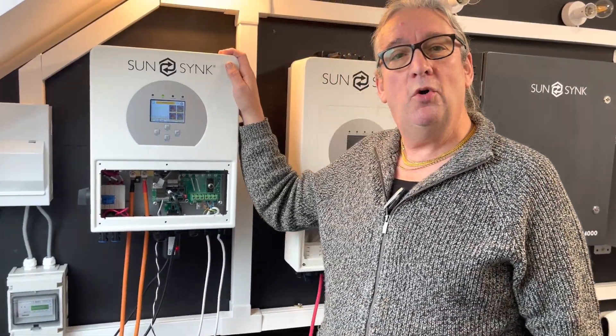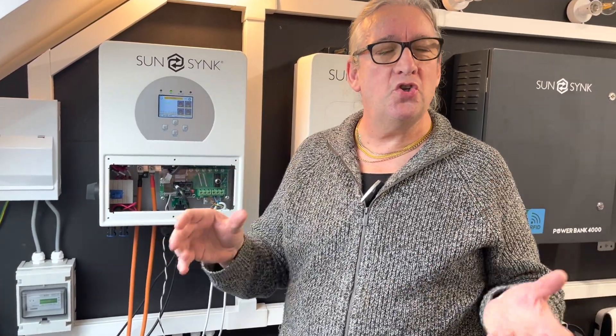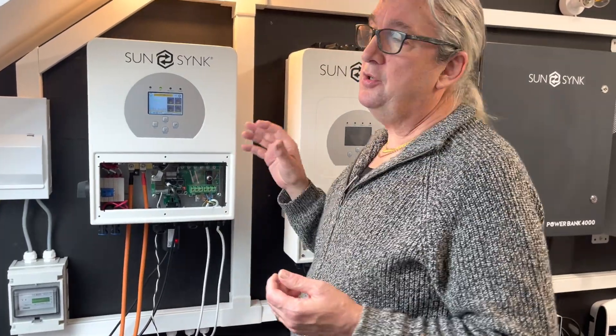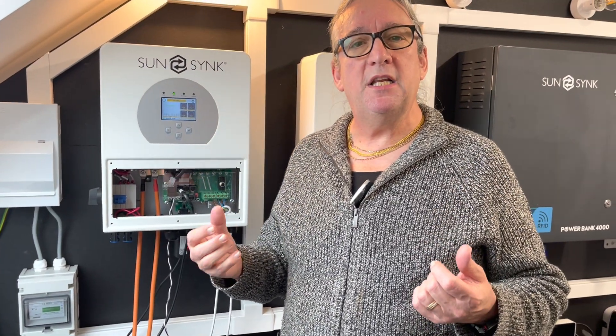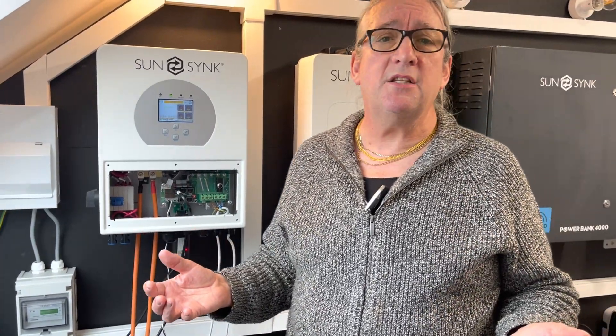You can use it off-grid, on-grid, everything. It's a compact all-in-one unit. It's quiet — it doesn't have big external fans, just one little internal fan, so it's ultra quiet. There's a sister product, the 5 kilowatt, but the nice thing about this for the UK is that keeping it under 3.6 kilowatts means we don't need any special approval. It also has UPS functionality, so with power outages you can have a non-essential and essential load — if you have a power failure it can keep your lights on at night. You can add inverters in parallel and add more batteries, both off and on-grid.